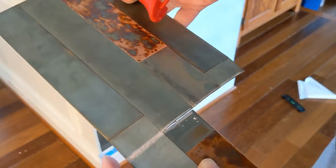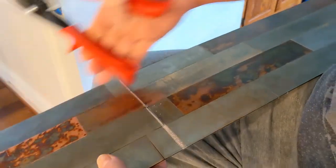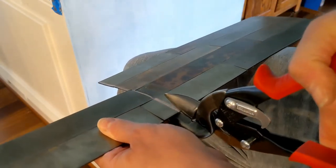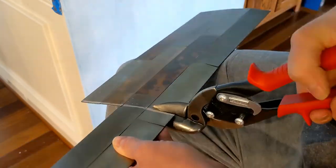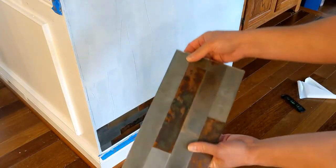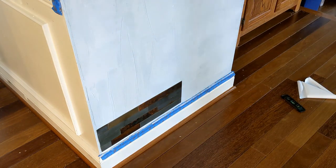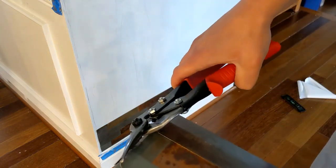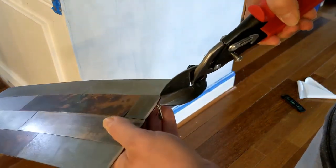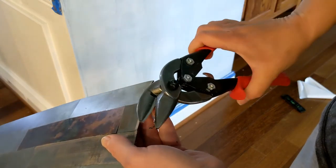These cut through it a little bit nicer. You have to be careful because with end pieces, you'll find it falls off, so if you have something to support it that's ideal. Don't cut your fingers off. You're going to have some sharp edges — you see this? That was a mistake I made. Go cut that little piece off. This is a good time to have a garbage can handy because you don't want those metal pieces falling on the ground and anyone stepping on them.